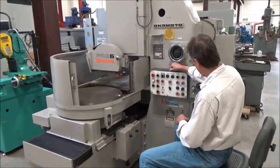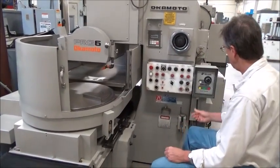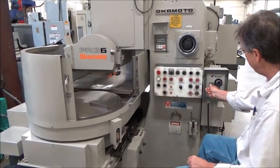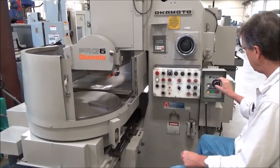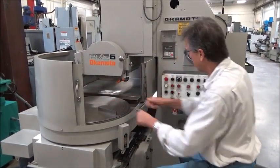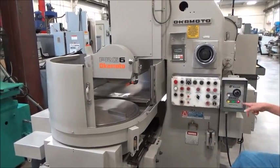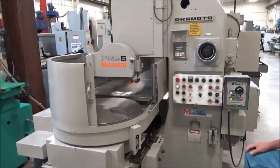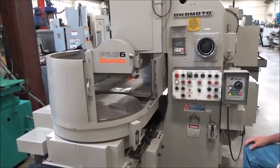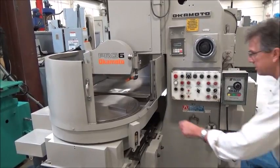We'll go right in with the chuck control. I'm just going to turn it on — I've got a little tool bit here. Going to variable. It does have an interlock. I'm at 30%, so I'm going to release it, let it pulse. It's going to do a D-Mag cycle, which is all good. That all works nice — it's a good, strong chuck.